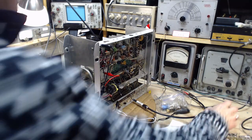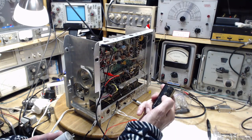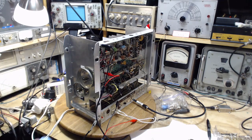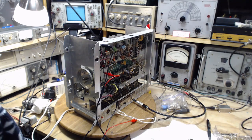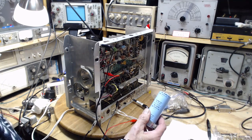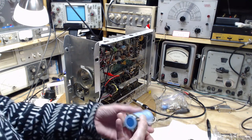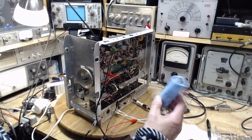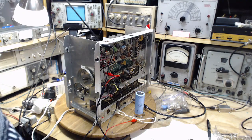So here I have a few capacitors. I have quite a number of these. This one won't work for it. This is a 10,000. Whoops. 10,000's a little too much. So 4,000, 25 volt, not enough voltage. This guy, 20 volts, 2,000. How about that? 1,000 microfarads, just what I'm looking for. 180 volts. No chance of this one being injured by pretty much anything I do. So this isn't the best thing to install, but this is a great one for doing some testing. We're going to hunt around and find out who's causing the hum.